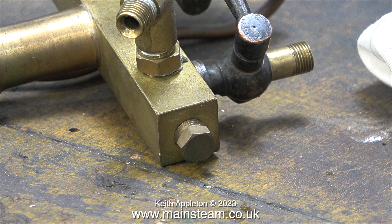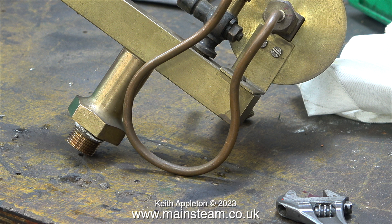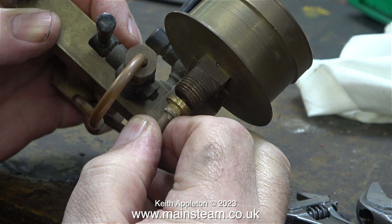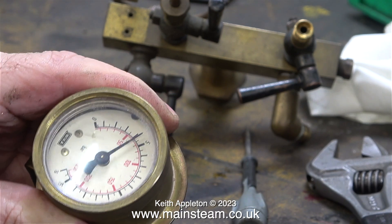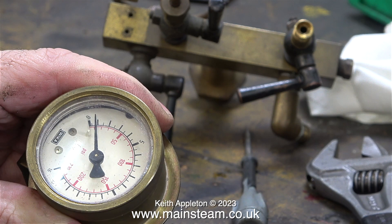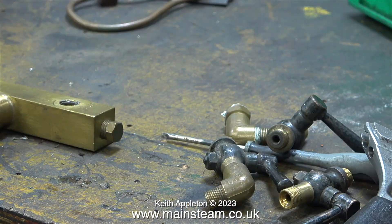Once I get the boiler back, there's going to be quite a lot of things to do. Not really the boiler itself — that's been certified and tested — but I need to make blanking plugs and a new turret. I've been asked to fit a turret isolation valve, and what I'm doing at the moment is dismantling the old turret just to have a look at how it's put together. The pressure gauge is faulty: when I apply some pressure it registers on the gauge fine, but when I release the pressure the needle does not return back to the stop, so I'm going to change this and buy a replacement 2-inch diameter gauge. There's going to be quite a shopping list for parts from Blackgate's Engineering for this job.